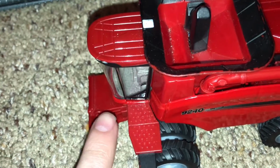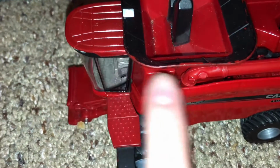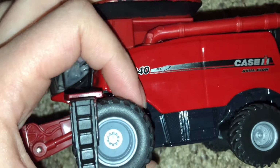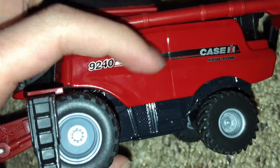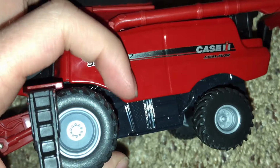There are basically belts that bring it around, and sometimes there are augers on the oldest combines that were first made. Then after it gets to the feeder house, it goes to what's called a rotor. It'd be right next to these tires here. It threshes it a little bit and separates the main material from the grain.